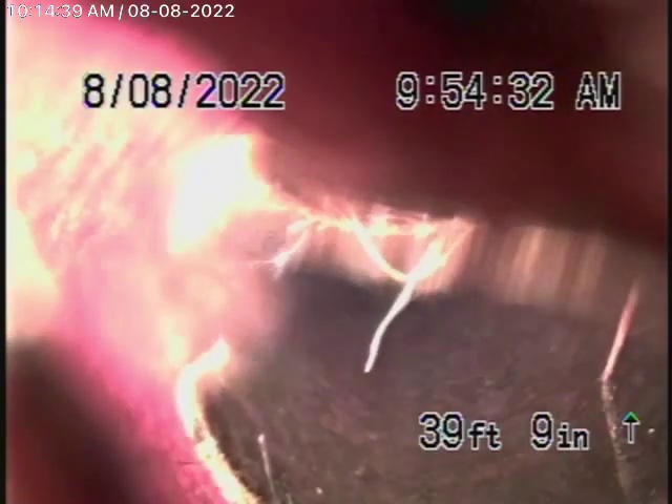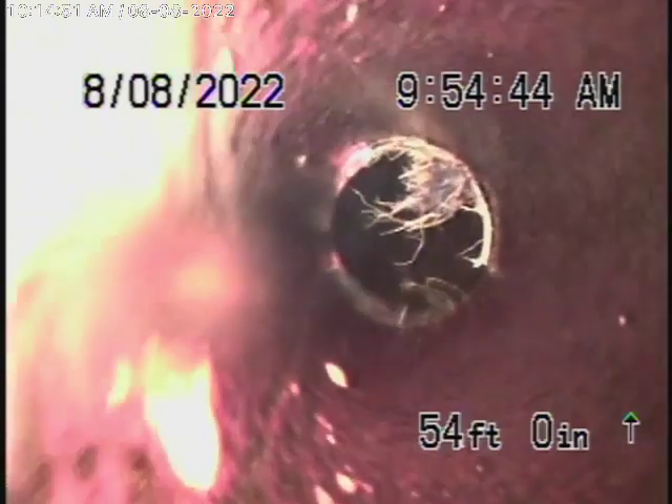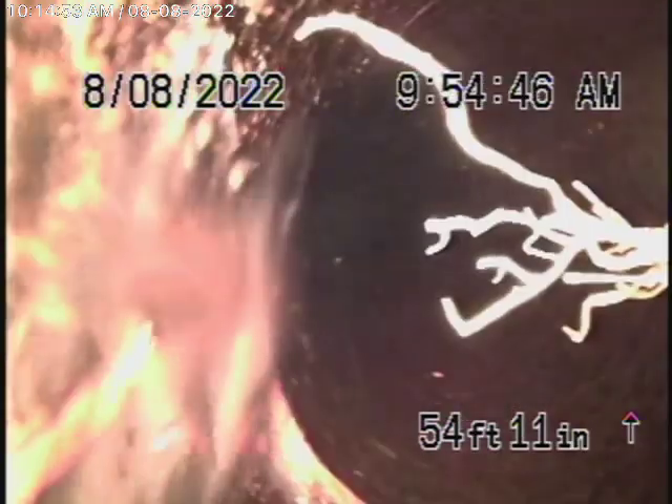The jetter went through but we felt something very heavy at the saddle. The sewer line is in very poor condition. You can see it's broken here, and broken over there as well — it's not good at all.